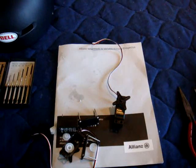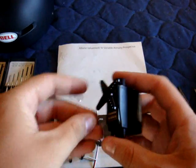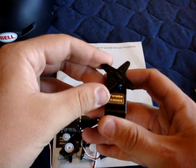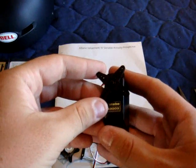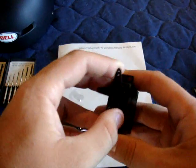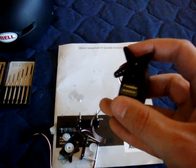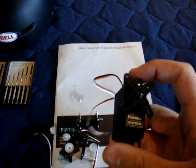What I want to show you right now is basically what a stock S3003 servo looks like when you first get it out of the box. It's all put together and you can only get the servo to move so far — it won't go any farther in either direction. So what we want to do is make it go all the way around and get full 360 degree motion. We're going to use this as a drive motor. It's a lot cheaper than buying a brushless or brush motor plus speed controller. These you can generally get for about 25 to 30 bucks, and they're relatively compact. The power's pretty good — they're a little slow, but for certain robot applications, that's okay.